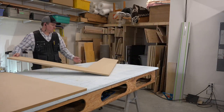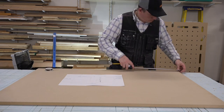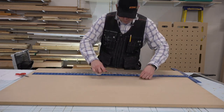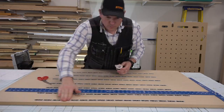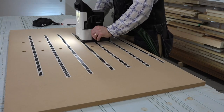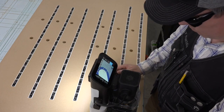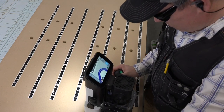The plans for the multifunction slab include a narrow shelf to go between some plastic sawhorses that they recommend. Since my aluminum sawhorses are a little wider, I'm going to maximize the width of my shelf to fit between the steps. This shelf utilizes the full four-foot width of the offcut and I'm laying out the location for the Shaper tape. Since the shelf only has holes in the center I don't need tape over the whole surface. At $15 a roll I try to make the most of my tape, which is also why I cut it with scissors rather than tearing it by hand. I already had the 10mm cutter in the Origin from cutting the dog holes on the worktop, so I decided to cut the holes first on the shelf. Origin is a really fun tool — I've used a full-size CNC at my local makerspace and Origin is much more engaging to use, whereas that industrial unit needed to be programmed with a steep learning curve. For everyone except a high-volume production shop, Shaper Origin is the better option.